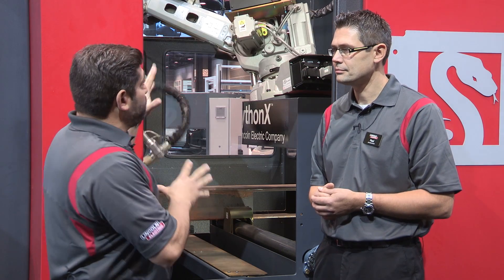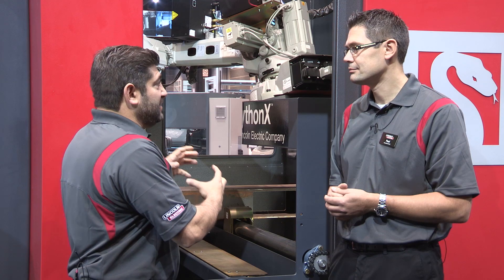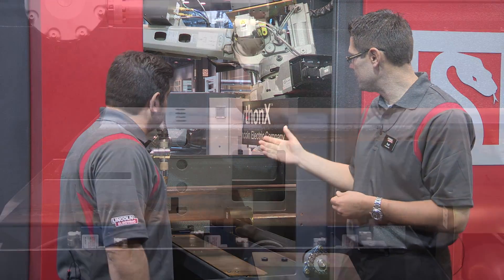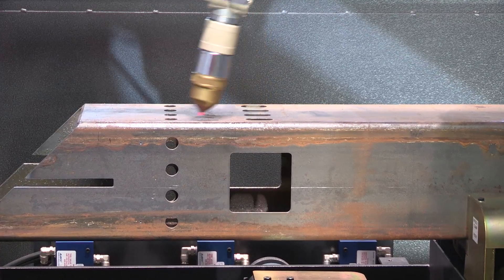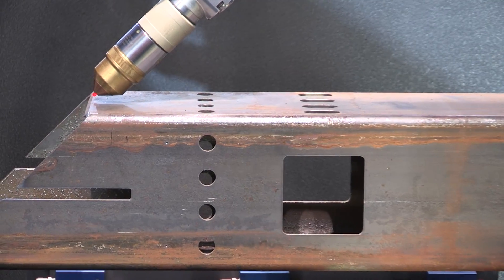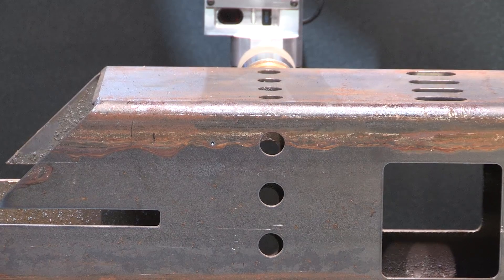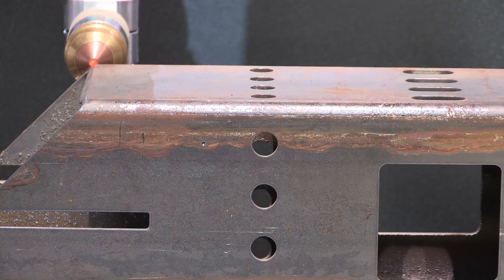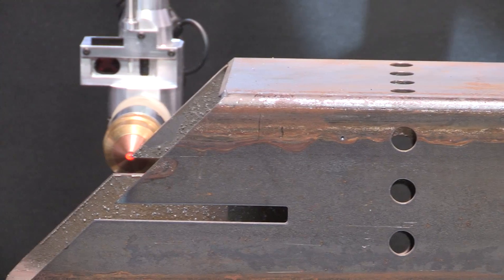Can you tell us a little bit about how this welded, enclosed system prevents a lot of vibration? One of the main features of this machine is that it can produce really good quality bolt holes, which displace the need for drilling machines. It's very important to have a stationary frame and a welded box frame to present the torch to the material with the least amount of vibration — that's how you get the best quality holes.